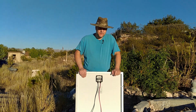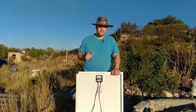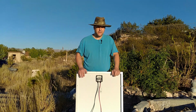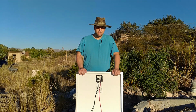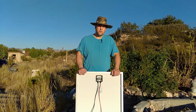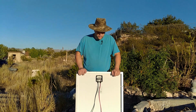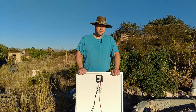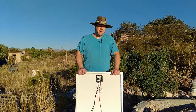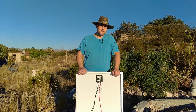Now, I don't like that very much for two reasons. One is it's actually a slightly higher connection. Slightly. Not a lot, just slightly higher resistance connection. But the second part is there's no mechanical force other than the solder holding everything together. Now, if you've got a really good solder joint, it'll probably never, ever come off. However, if you have a solder joint where there's a little weakness in it, over time, as you've got heat cycles and stuff like that, it could theoretically crack and the wire can come out. And instead of theoretical, I've actually seen that, so it can happen. Yes, it does take a lot of time, but I'm not really interested in suddenly going, why did the solar panel quit working suddenly? And it's been 6 or 7 years.